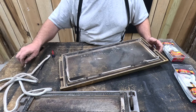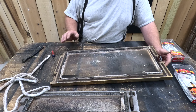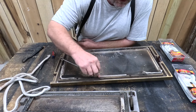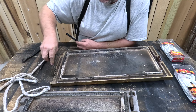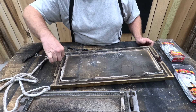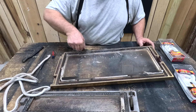If your groove is not that deep, you'll need that cement, but mine didn't need it. So we're going to get this all cleaned out and then replace both gaskets, because we don't want any air to leak around this door when we're burning. The more air leaks around there, the less control we have over our fire. We've got a wire brush — one of those pipe cleaners — and it fits right down in there. The biggest way you can tell whether your gaskets are going bad is when you can't control your fire. When you turn it down and the fire doesn't go out, you're probably leaking air somewhere.